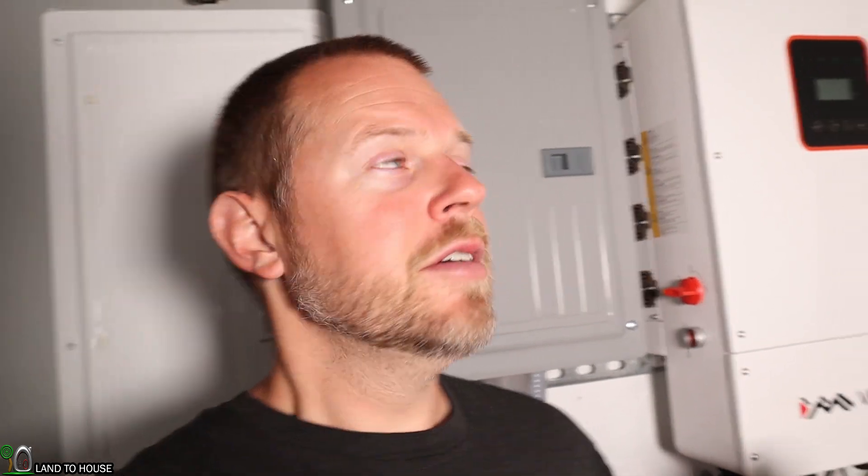I've had quite a number of people asking for an update, so here you go. I've been very pleased with having this battery and inverter running my house off-grid. As far as loads go, I've had the refrigerator, dishwasher, toaster, and microwave all going at the same time, along with my washing machine, and I've never even come close to using the 8,000 watts this thing can put out. Whenever you have several of the bigger loads going, the cooling fans will kick on pretty loud. The idle state of this inverter is pretty loud, so you definitely want to have this in a quiet room or closed off. Whenever I have the battery somewhat discharged and full sun is hitting the panels — getting close to 4,500 watts — the inverter fans will kick up real loud, so you definitely know when the clouds are passing.